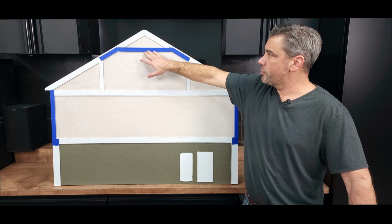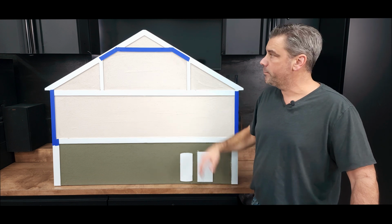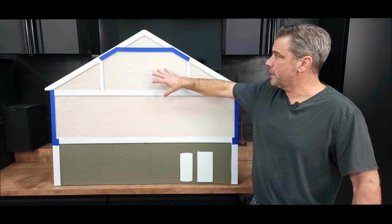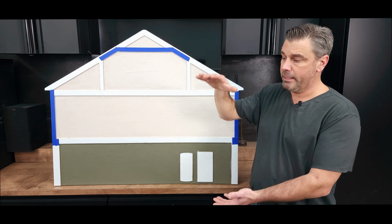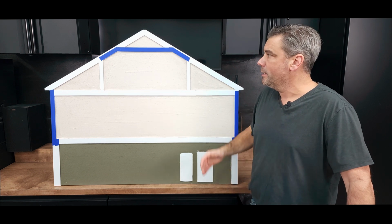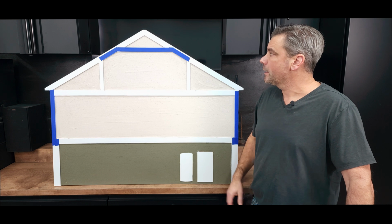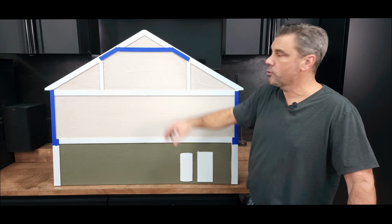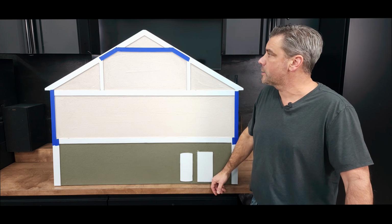The flat, there's two ways you can set that up. This is the way that we would normally recommend doing it because it's unusable space the majority of the time. So there's really no reason to heat that space, in which case we would loose fill that base with about anywhere from 14 to 18 inches of cellulose and bring it to that R49 or maybe even an R60 up there. I'm going to show you another way to set that up if you choose, but really this is the majority of the time on a retrofit type of residential. That's usually how we set that up.